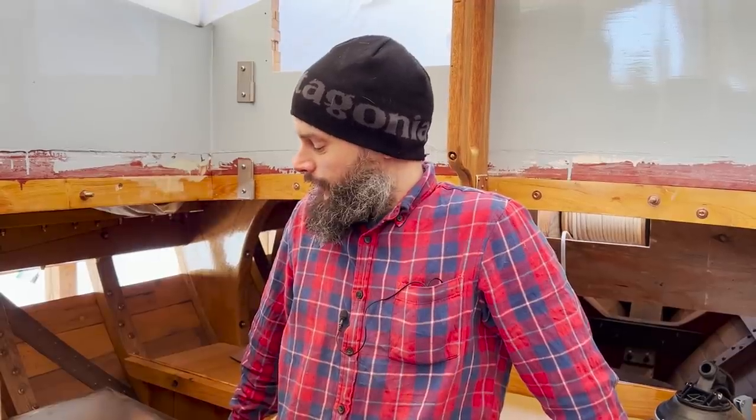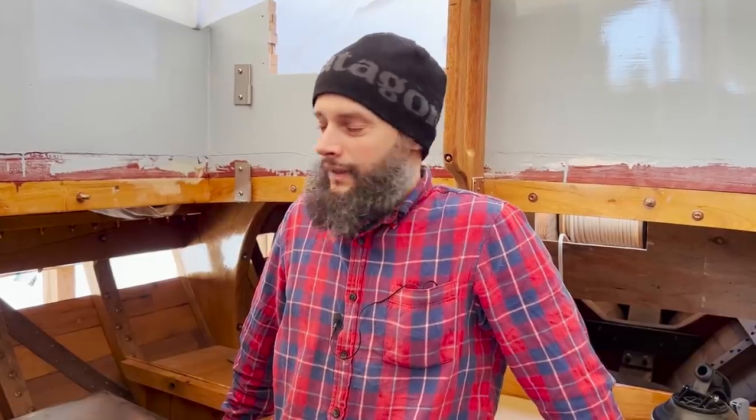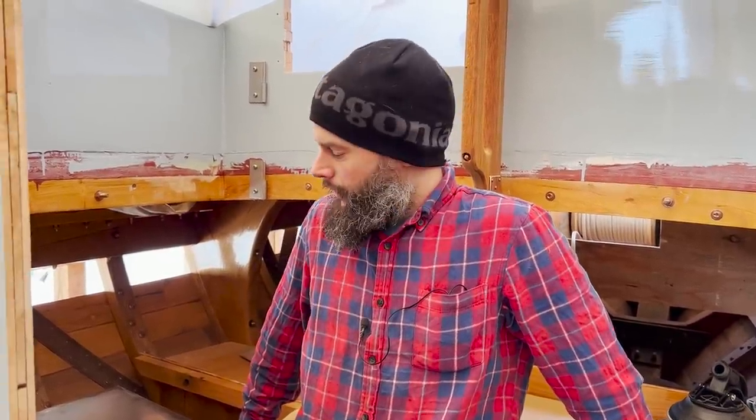So that's not bad. We're in the ballpark. If we didn't have a water maker, I would be more concerned. But I intend to put in a water maker, so that should be sufficient tankage. And it saves on weight in terms of the tanks and the water, and it also saves on space. You can see how much space these things just ate up. So finding another, say, 30 gallons would mean we need to put another tank this size in the boat to get another 30 gallons, which I don't really think is worth it.